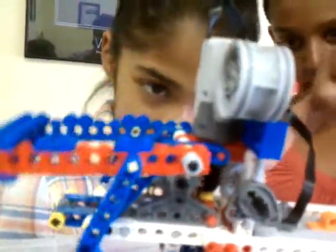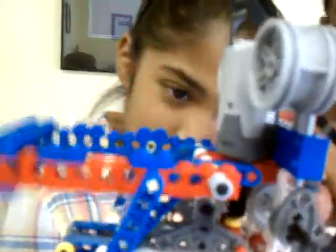How does the power get transmitted from the motor? The motor goes through this black — the black worm gear — goes up through here, and it goes through these two gears. This gear moves here to move the tail. This one moves the mouth. And then it moves the eyeballs via the cams.